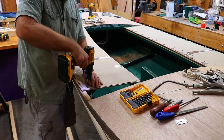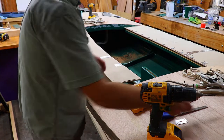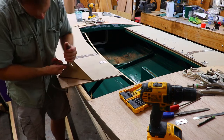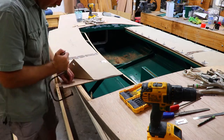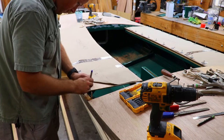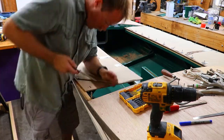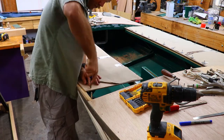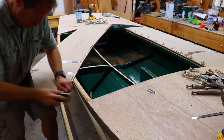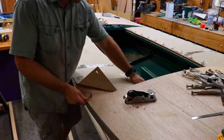First I have to drill out the hole for the chain plates in the seat panels. I drill a hole at either end of the slot and then use a coping saw to cut out the waste material in between the two holes. I also trace out the chain plate cover. After that I use a file to clean up the hole. With that done, I check the fit of the hole in the seat panel over the chain plate, and then trim the end of the seat panel down with a hand plane so that it fits flush against the deck beam of the fore and aft decks.